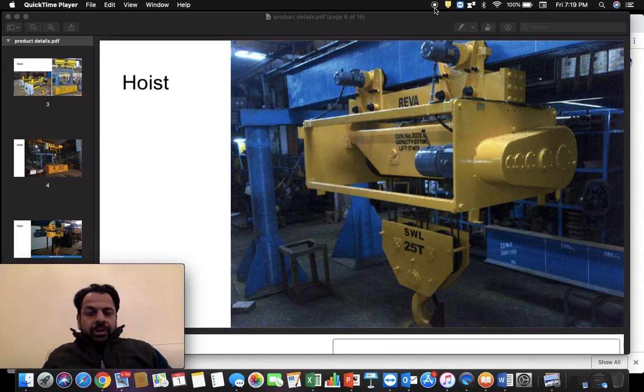Welcome to this video where I'll be talking in more depth about the hoist, deep diving into the components of a hoist so you can better understand what it is. For anything to move electrically, you need a motor. In this particular case we are manufacturing an electric wire rope hoist — electric meaning it's an electrical device, wire rope meaning the arrangement wound on it is a wire rope, as you can see here. A hoist is equipment which lifts any load up and down.